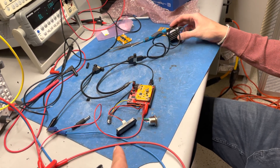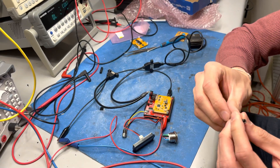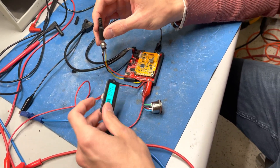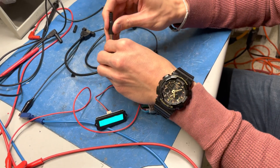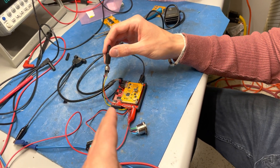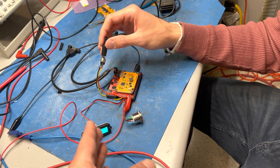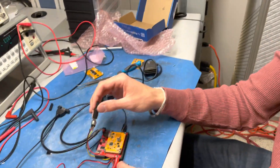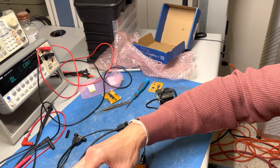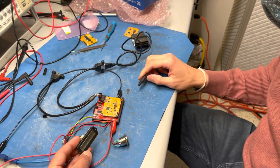This also has a smart charge capability. You've got to charge your batteries at some point — we provide you a barrel plug in the kit and a smart charger port. When you plug this in, it'll turn on the battery capacity display. Let's watch that again: disconnect it — it's off; connect it — it's on. So you don't have to have the battery on or your power wall on. The moment you put the charge port in, it tells you the state of charge of the battery and shows you in real time as it's charging. The button LED is not on, meaning the system is not pulling current, and you can verify that because the bike lights are not turning on. This display can be programmed for up to a 16S battery, and you can use pretty much any display with this application.